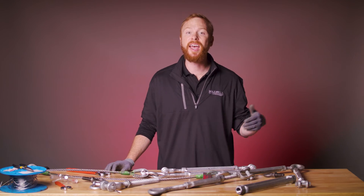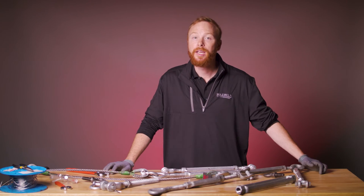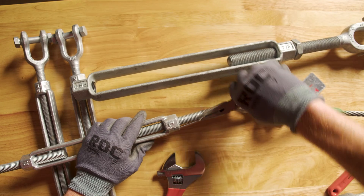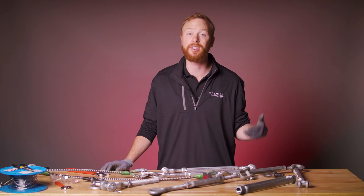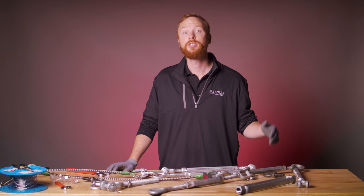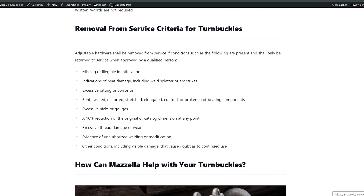The great thing about a turnbuckle is that tension can be applied without twisting or rotating your rope or cable. Last step: if you are using a jam nut, tighten the nut down to the body. If your turnbuckle is being used for a critical application, use lock wire to prevent end fittings from turning. A turnbuckle may be used on its own or in conjunction with other turnbuckles to increase length in the assembly. Always keep your working load limit in mind when installing your turnbuckles and do not exceed it. Don't use your turnbuckle if any damage appears to be present. Check the link below to find out how turnbuckles are inspected and what rejection criteria you should be looking for.